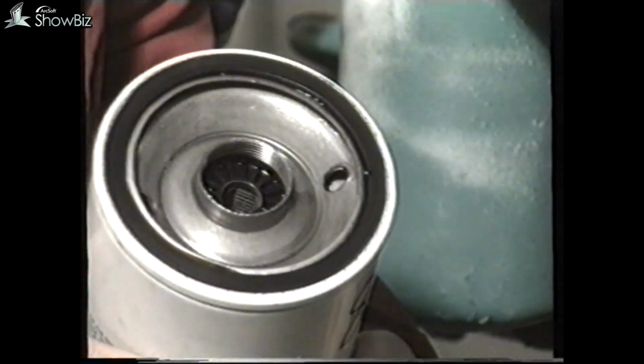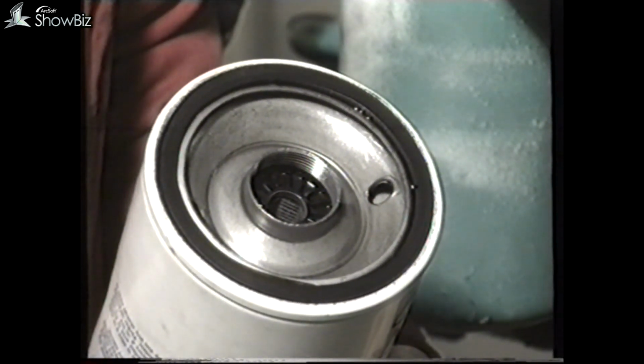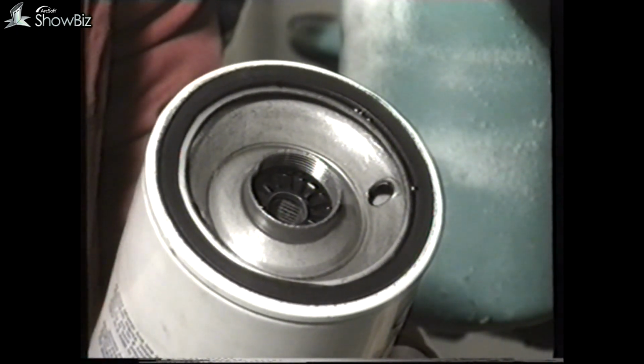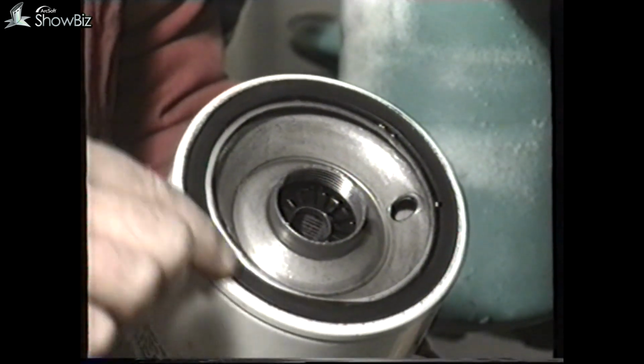During replacement, pre-charge the filters with engine oil to avoid undue starvation to the engine lubrication system on initial startup. Before replacing the filter, lightly lubricate the seal. Then, tighten by hand till contact is made with the filter head, and rotate a further half to 3/4 of a turn.